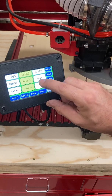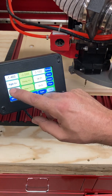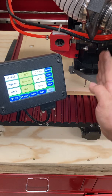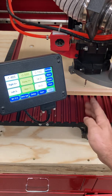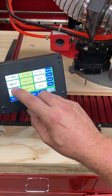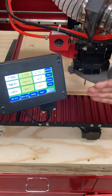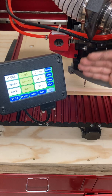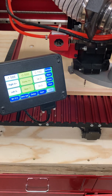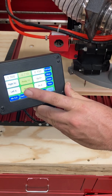I do find it easy to get the Z axis close, but not touching my workpiece. Now that I'm close, I'm going to go to slow. In my X axis, I'm going to line up the centerline of my cutter as centered on that dot as I possibly can. That's pretty close. And now I'm going to do that same process of lining up the centerline of my cutter with that point — but to do this I really need to be down on the left side or the right side and visually look and line it up. And that's pretty close.